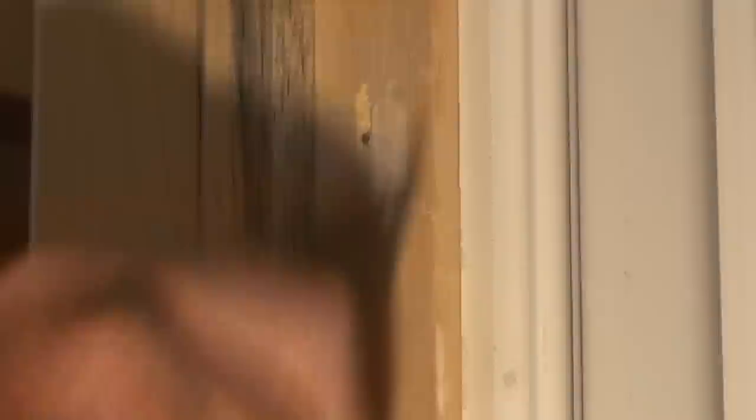When you come to new construction and you have a blister where the wood has blistered up, you want to pick all that out of the blister so you have a flat surface. When you put the putty in, it's the same concept — then wipe, and you have a nice smooth surface. Always keep the knife flush and pull back.